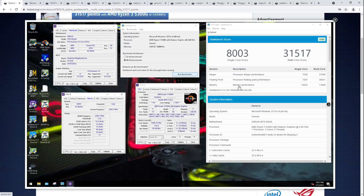For integer performance, the 5300G actually has an advantage. I'm guessing the integer test either isn't as cache-intensive, or that's where the IPC improvements of Zen 3 are more significant than on Zen 2, because different instructions are going to see different performance gains going from one architecture to the next. And of course, the memory performance on the 5300G is way higher.